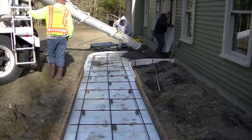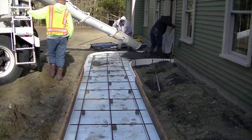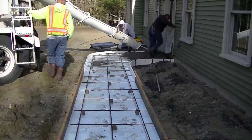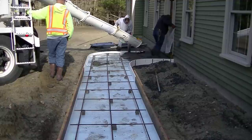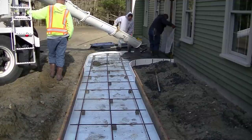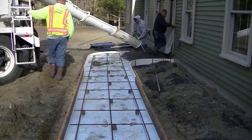If there's ever going to be a beginner's type of walkway or a DIY type of walkway, I guess this would be it — something four feet wide where you can ride the screed board right off the top of the forms. The only thing that might be a little easier is if there was no curve to it, if it was just straight. But even with a curve, if you're using those Azek forms, it's pretty easy to curve something with those.